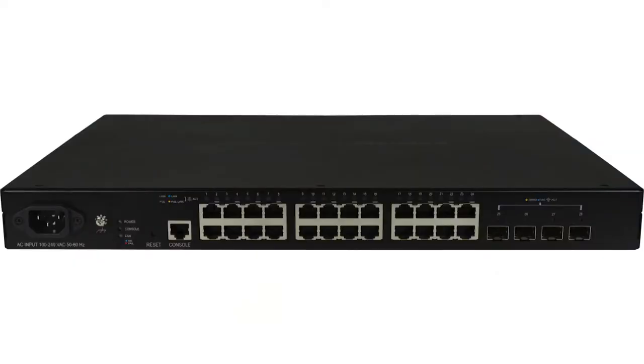Does anyone want to know if we've got new gear? And this week I'm having a look at the S3-24P. It's a network switch built for AV. That's something that's been letting the adoption of AVB down over the last couple of years — network switches that are actually enabled to do AVB. The S3-24P is a layer 3 switch designed just for us people in AV. It's got rear-facing ports, dynamic routing protocols for greater isolation and control, making it ideal for enterprise networks. You can enable multicast from the GUI and it offers superior streaming over complex networks, which is necessary for running things like video over IP. It's got a power budget of 370 watts and has 24 Power over Ethernet ports, which is always useful.